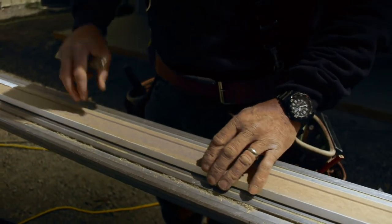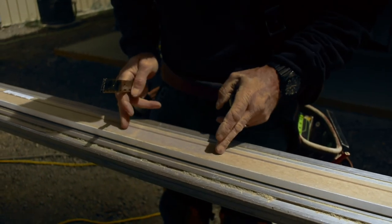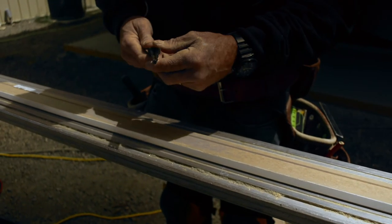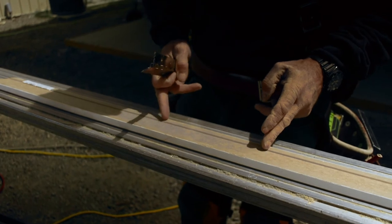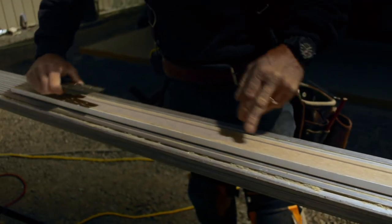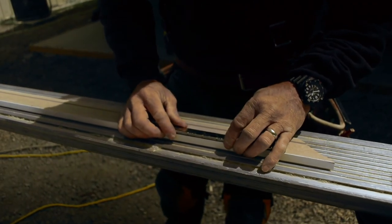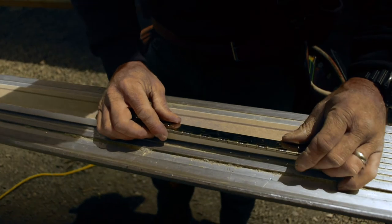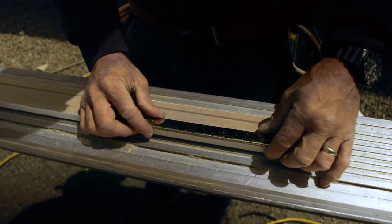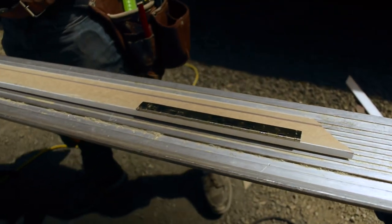So here we have our header trim, our top piece that's going to be the hinged portion to hide this little cubby up there. So I know I have a spot right behind here, so I'm going to go all the way to the left, all the way to the right, and I'm going to install a piano hinge, and it's no big deal. You can get it right up to the edge. You could even go a little proud and stick it up a little higher to make it easier. You just can't see it from the ground unless you're very tall.